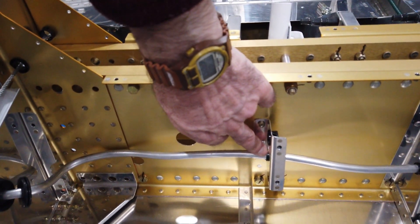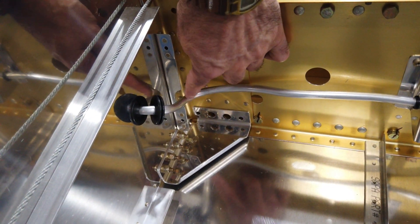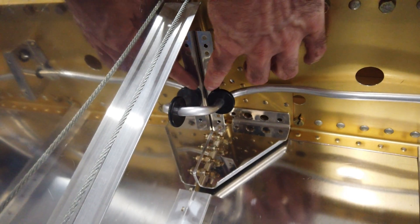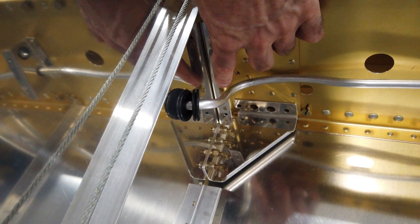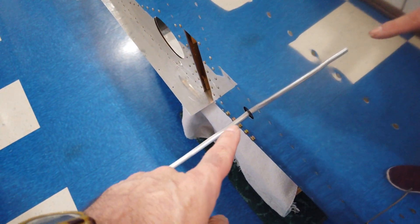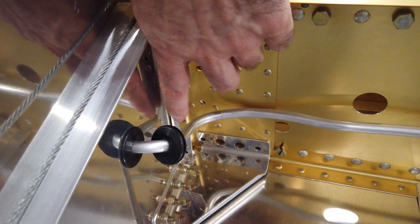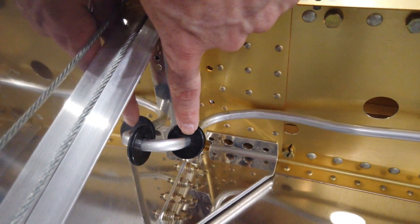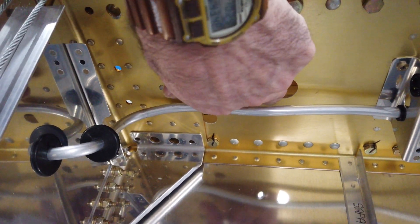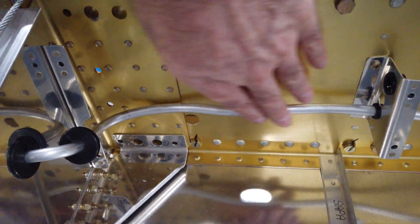On this run of the line you've got to make a tight 90-degree bend so the line passes through the center of this hole where the grommet's going to go. Then it's got to make another bend to go through the fuselage — you want it to exit straight so it can attach to the wing. This straight run has to be centered on the grommet hole, and you also want to make sure it clears these accessory holes in the spar in case you want to run cabling or wires through there. There's a lot of bending in this area and it's not perfect.